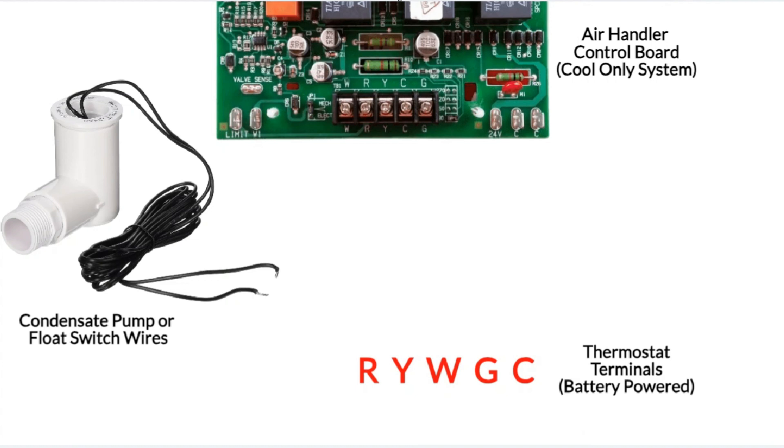Now let's cover the circumstance where we have a high efficiency furnace. A high efficiency furnace generates water in heating mode. Normally the wiring on this type of system has 24 volts going up to the R terminal on your thermostat, and a white wire coming back from W to activate heating mode at the W terminal on the control board. If you have a battery-powered thermostat, interrupting this 24 volts between the R terminals would be perfectly fine — just run power to the switch, from the switch up to the R terminal on the thermostat, and leave the W wire to the control board as is.